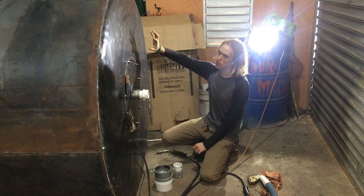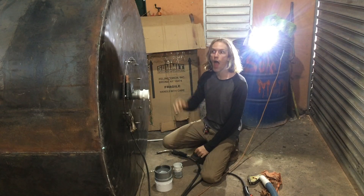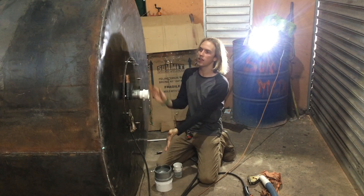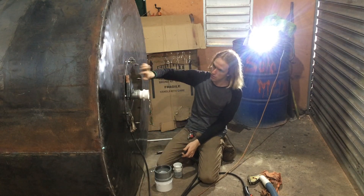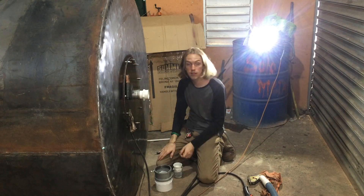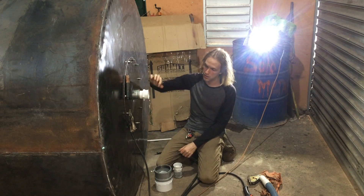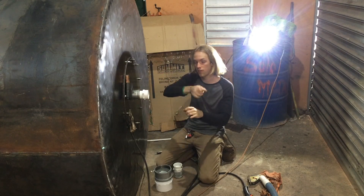What we did today is go inside the tank with a 3-pound sledgehammer and beat the living daylights out of it. You can probably see it's a little dented — they're not going to matter aesthetically and may not look as pretty as you'd like. But it caused the tank to be slightly domed. We didn't hit it near the center to keep our seal good with the lid, then we bolted the lid on. It looks like it's going to make an incredibly good seal.